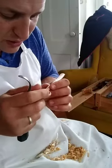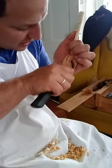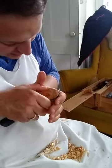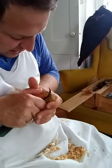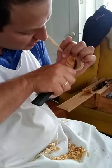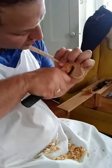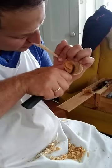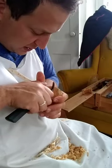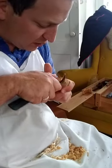And in general, this is one of those places where, if I had to describe it, I try to make the rim thinnest on the sides, then sort of medium in the back shoulders, and thickest at the tip. And that helps keep the tip of the rim stronger, which is helpful. Another problem with grain like this is that it makes it really hard to see what the true lines are, because your eye is being constantly pulled and distracted by the grain.